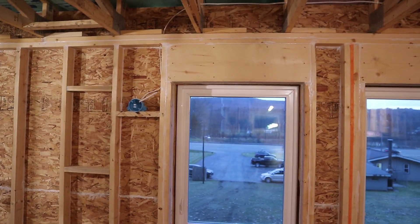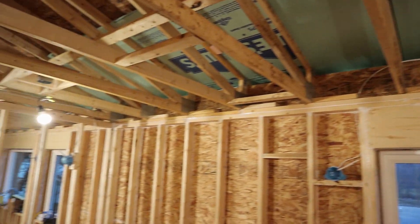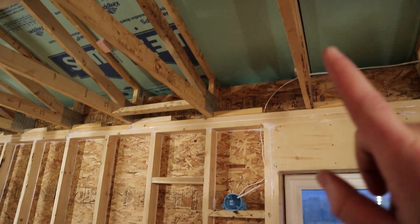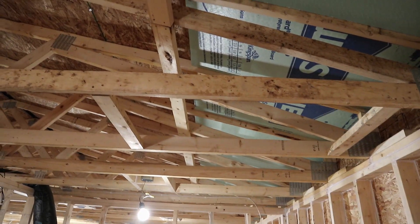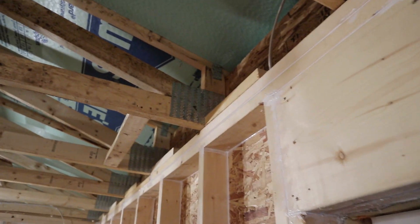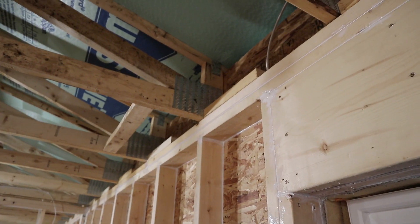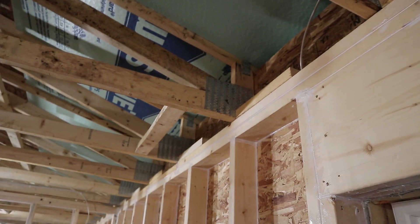I also blocked off the ends here. My ultimate intention is to get a quote from Space Foam for spray foam for just that perimeter foam section. I want to do that because right there I have like 24 inches of height and really need a minimum of 20 inches. But down here I only have like 12 inches of height, and 12 inches of insulation is not enough to prevent ice dams. So I need a little extra performance there, and I can get that by using spray foam.